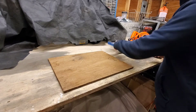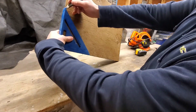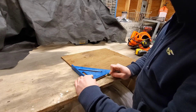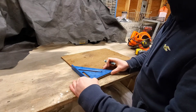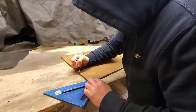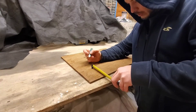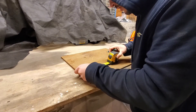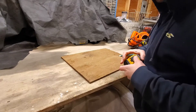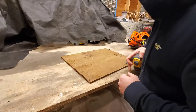The first thing we're going to do is measure out our plywood. This is a speed square — it's a right angle. Put it on the very corner and make sure the top and bottom line up so it's a square cut. I'm going to mark it at the 4-inch point, then flip it over and do the same thing on the other side at the 4-inch mark. Then we'll measure 4 inches to the top and 4 inches from the other side. To check how close you are to being square, go corner to corner — it's 5 and 5/8 both ways, so we know we are good.